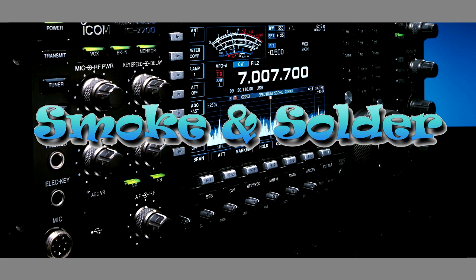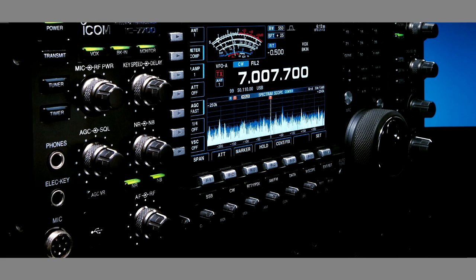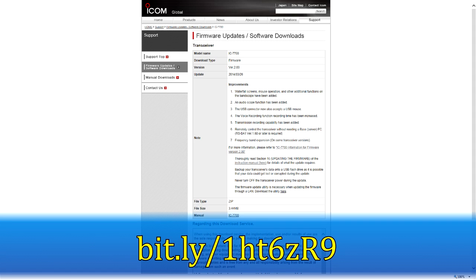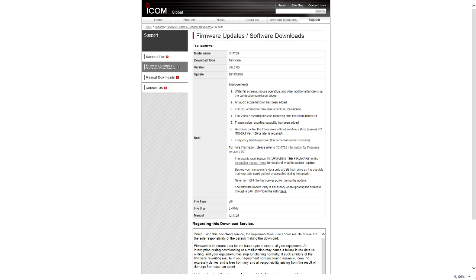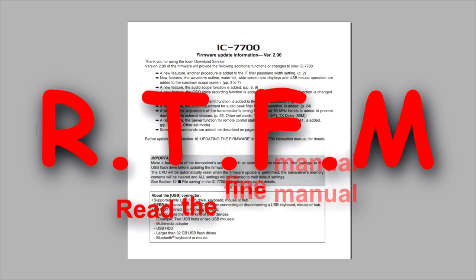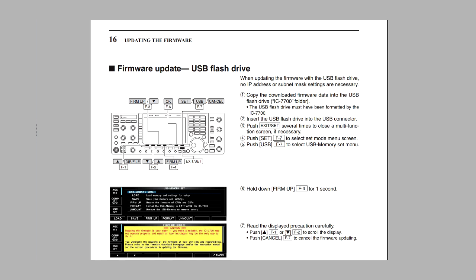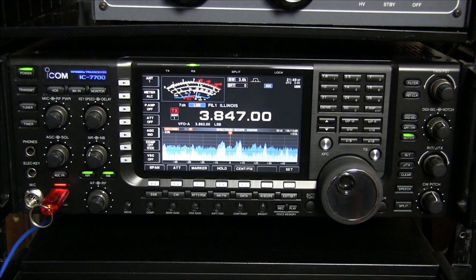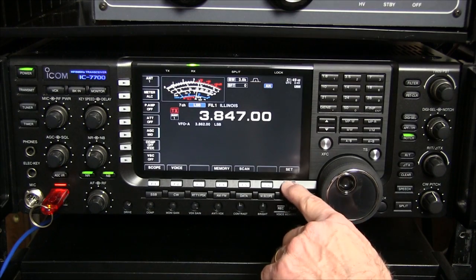In this age of digital technology, many radios have a firmware operating system that tells a radio how to behave. ICOM recently released a firmware upgrade for the IC-7700 and I've been wanting to put it on mine. The first thing we need to do is download the firmware. Here's the link at the ICOM Japan website. All the files are there for the firmware upgrade, as well as a couple of documents about the firmware. Once you've downloaded everything, there are a couple of notes you need to read. It's very important you read the manual so that you don't brick your radio.